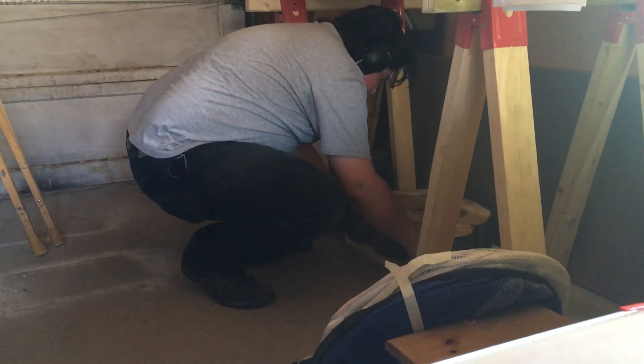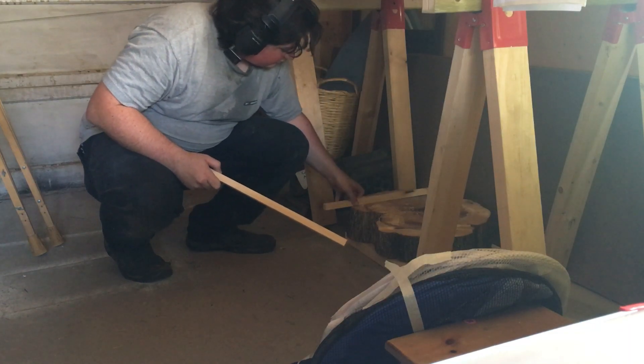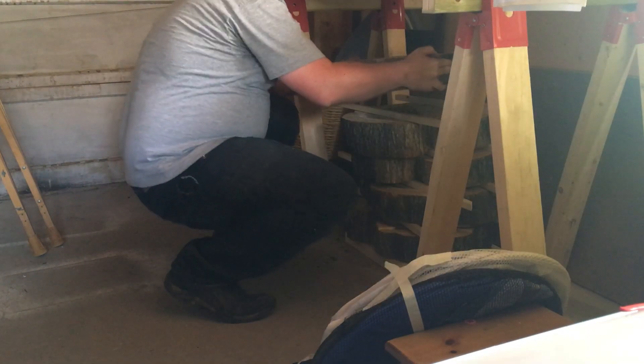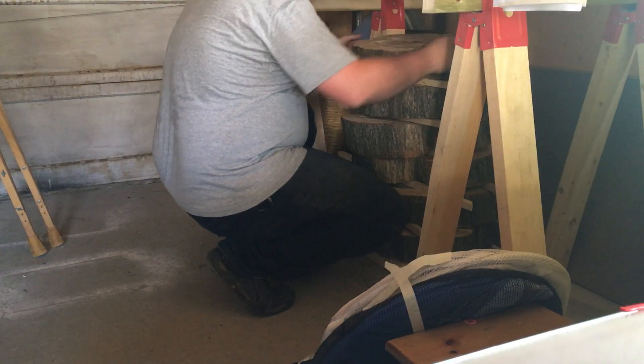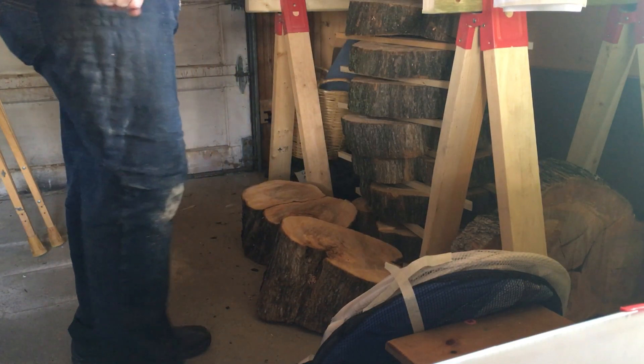With the cookies sliced up and moved into a corner of the garage, I stacked them with evenly sized pieces of wood — also known as stickers — to allow airflow in between each cookie to dry them out, also known as a sticker stack. Since these cookies are mostly end grain, they really wouldn't have needed long to dry, and I really should have coated the end grain with something to seal them up to allow them to dry out a little bit slower, but I didn't, and pretty much all of them split right down the middle somewhere. Either way, they spent the next few years in their sticker stack getting shuffled around my shop.